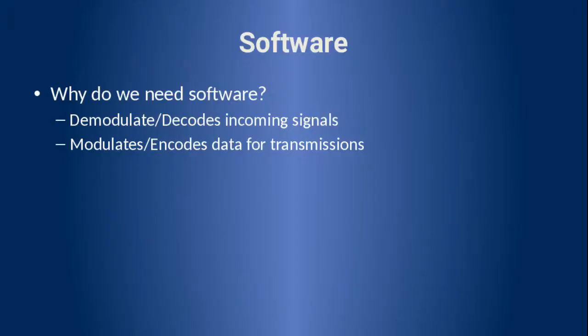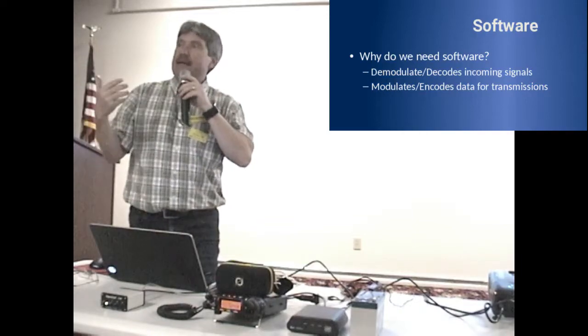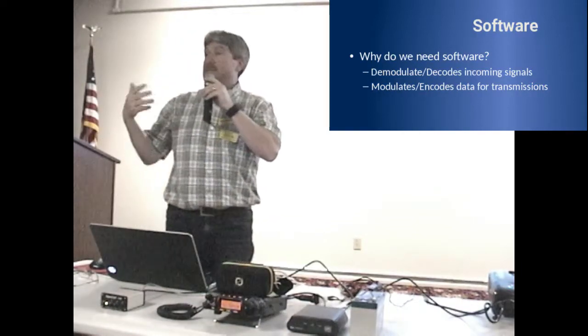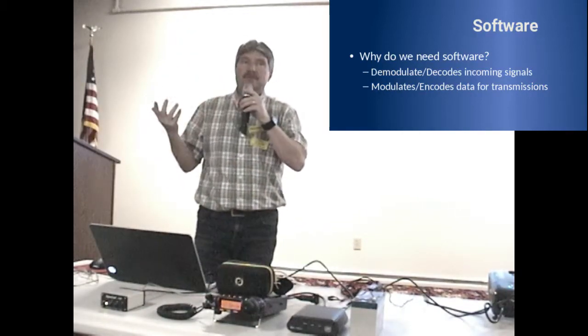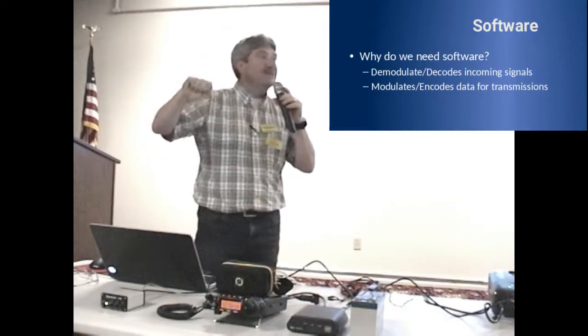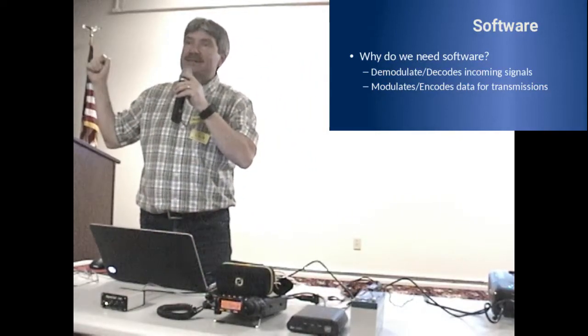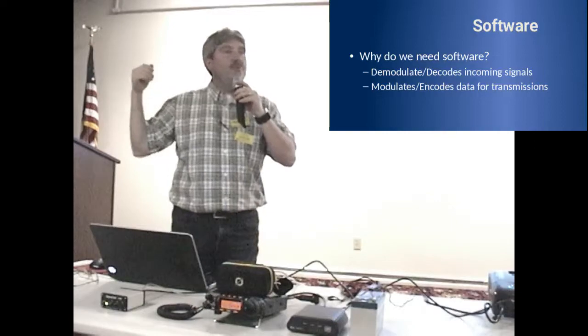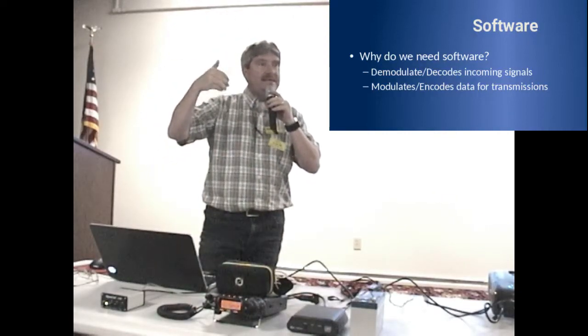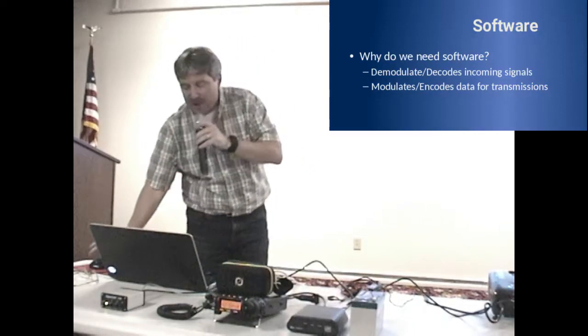So software. Let's talk about the software. So why do we need it? Well, the software is what takes the digital data that comes from your sound card and actually demodulates it or decodes it. It'd be the same thing like if you're working CW, you listen to the CW, you turn it into letters. That's what the software does. Same way the other way. You want to send out some information. The software then converts that, makes that digital signal so that the sound comes out looking that way. And that's the main purpose for the software.